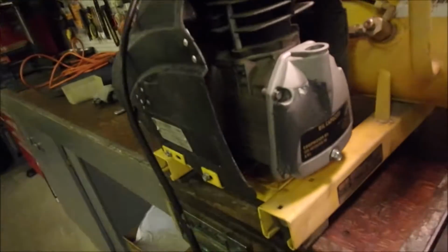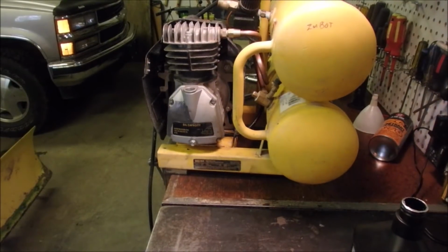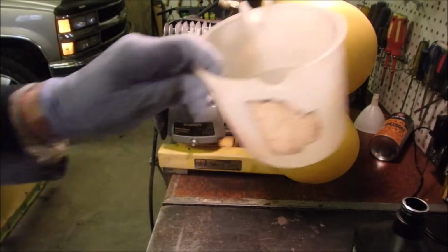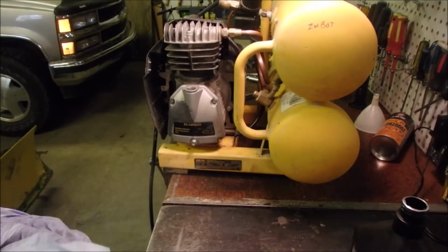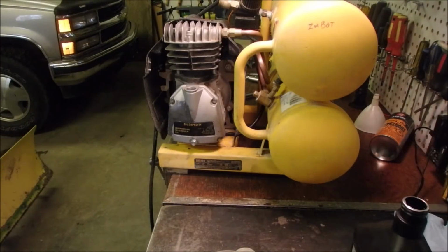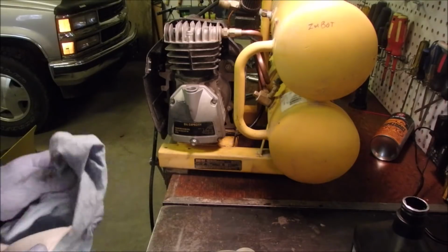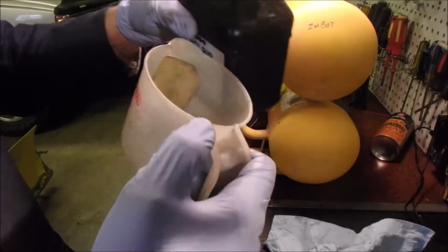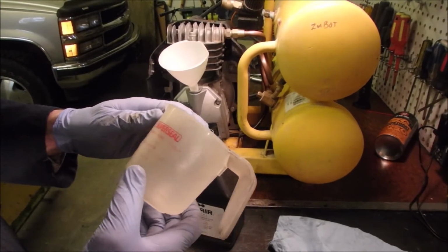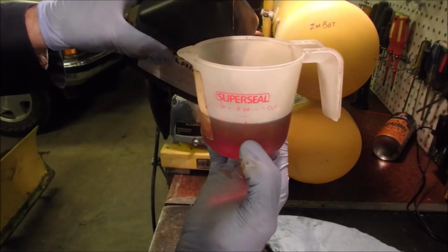Now there's my JB weld repair on that cracked surface. And we're going to put 6 ounces of oil in there. I just got to get something to measure it with. Oh, there we go, 6 ounces. Piece of cake. Funnel. Good. 6 ounces. 8 ounces in a cup, 6 ounces in 3/4 of a cup. Six on the schnozzeroonie.